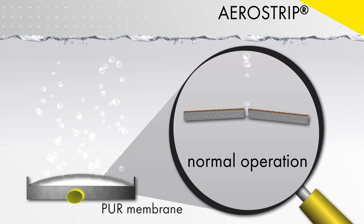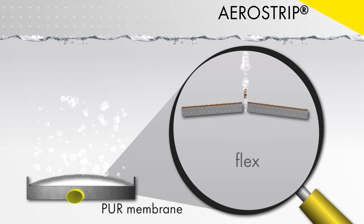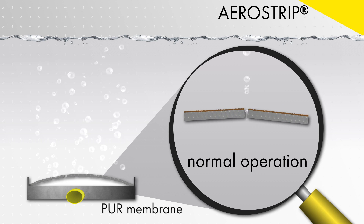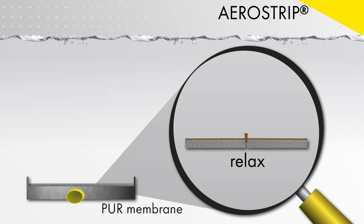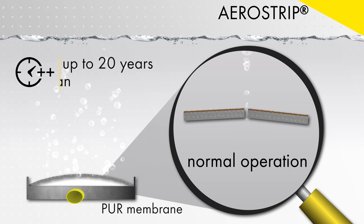During this relax step, the pores will loosen the biofilm growth in the openings and make the flex cycle much more effective in clearing the biofilm from the pores and preventing fouling from occurring over time. This relax-flex cycle is recommended daily and is typically completely automated. The duration of the cycle is generally between three to five minutes in length.